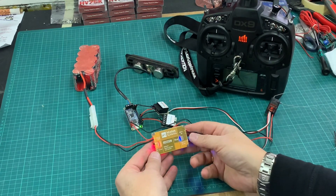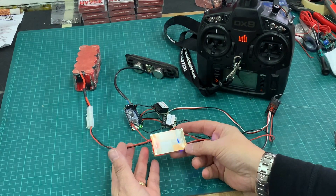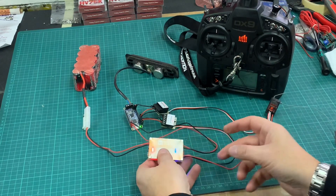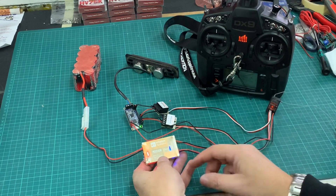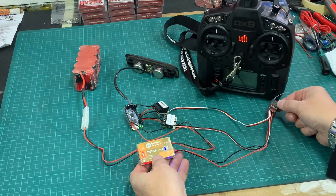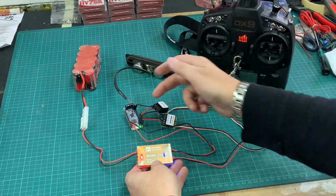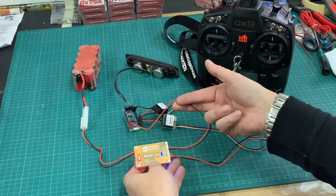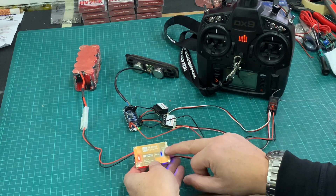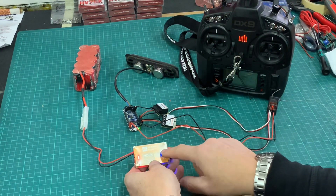What we've got here is the UBEC by Matex Systems, which is very useful — it's 7 to 26 volts in, so I should be able to use it in any of my droids; some run off 12 volts, others 24. I'm just running off a 12-volt battery to bench test it at the moment. You've got two outputs: a permanent 5-volt output, which I'm currently using for my receiver, and a second output that can be adjusted from 5 to 12 volts.